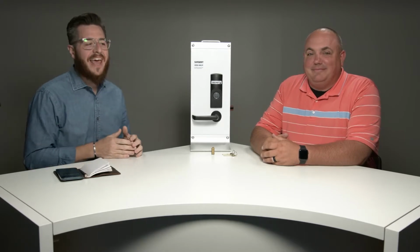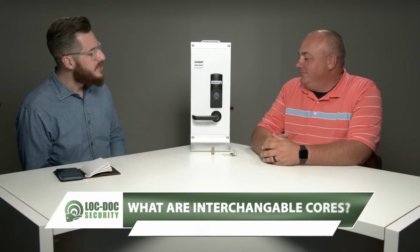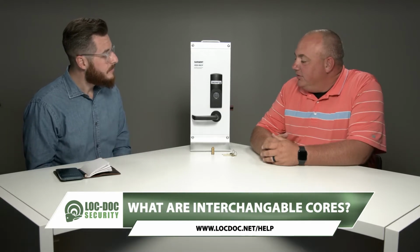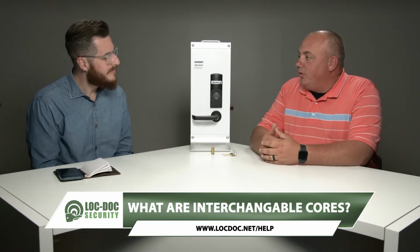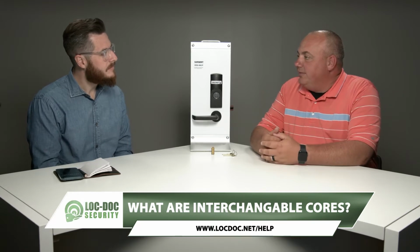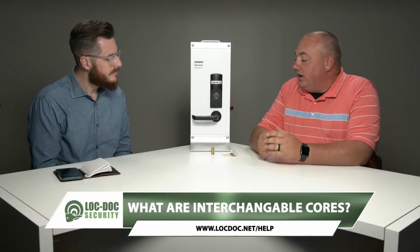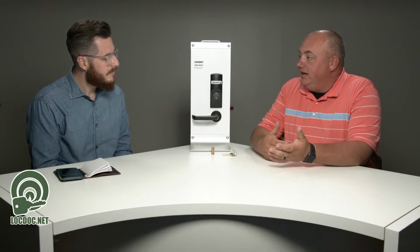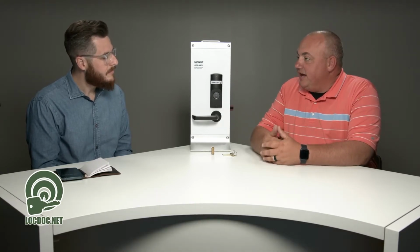We're going to be talking today about a quick way to change out the key for your particular door, right? Absolutely. So instead of having to take all the hardware off, the interchangeable core gives you the ability to just about anyone can walk up, put a key in, replace the core. You could lock someone out if needed, or quickly rekey a space that has a security concern.